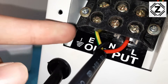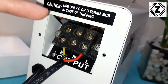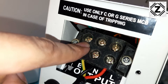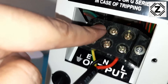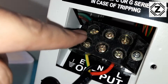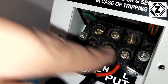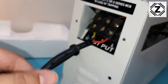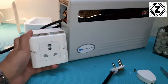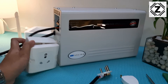Very simple to understand. Just strip your wires, put them in here, and make sure the screws are nice and tight. Use a good screwdriver and a good tool. I also tightened the input side terminals - I noticed on my model these were loose, so you might want to check that before you start using the stabilizer. I tightened the upper three as well as the wires. This small wire goes into this cute little board - the stabilizer and the small board sit together like a father and child.